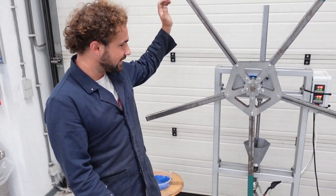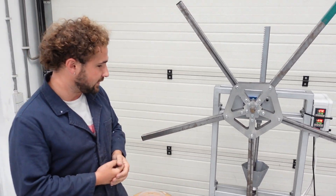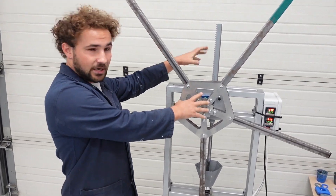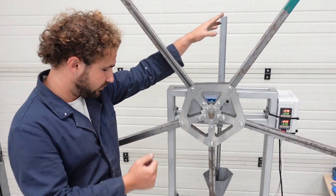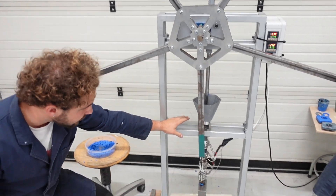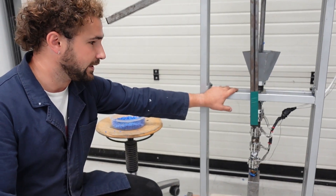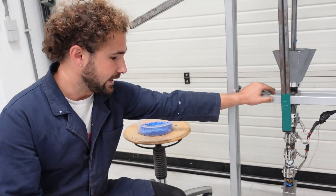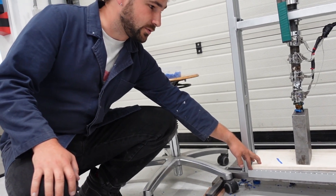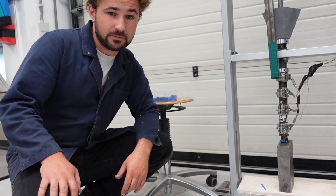Let's go check out this machine. All right, there she is. This is the first prototype we made. The final design is probably gonna look a little bit different, but this is the first idea. To break it down: this is the Arbor part where it has a wheel where you can apply force and there are gears that transmit force to the injection part. Then here we have the barrel, which is pretty similar to the current injection machine. The main difference is that it has a nozzle that can auto-engage with the mold so you don't have to screw it in anymore. And lastly, below we have the mold table, which ensures you can place molds of different sizes while still maintaining a really good, safe connection to the barrel.